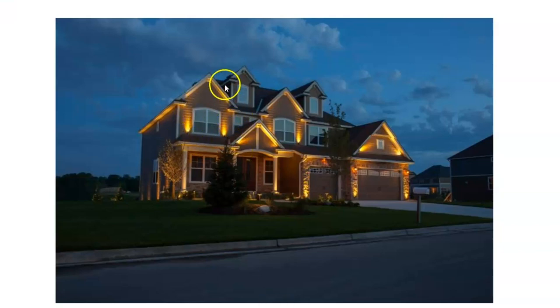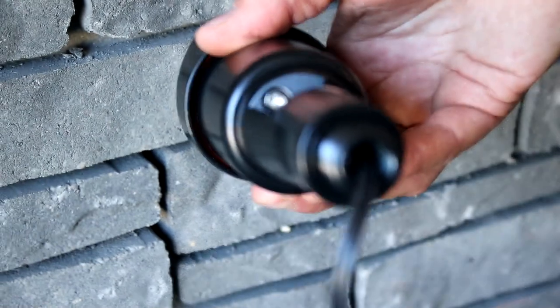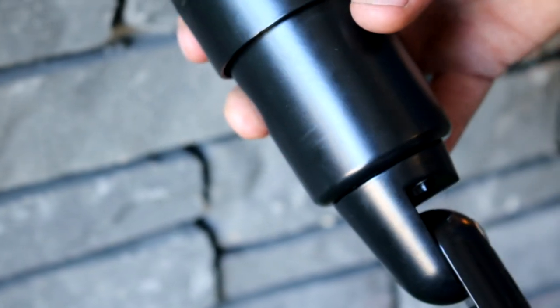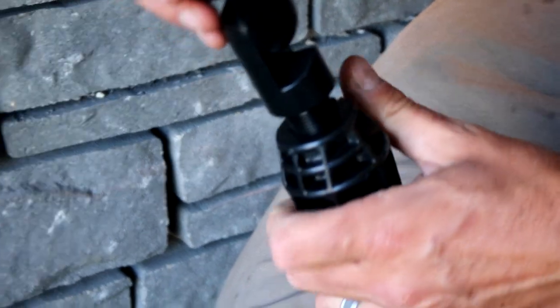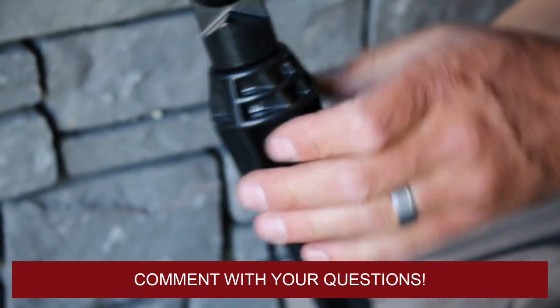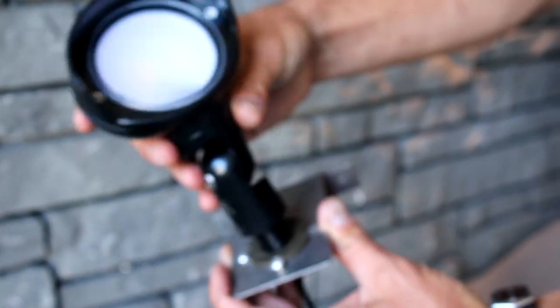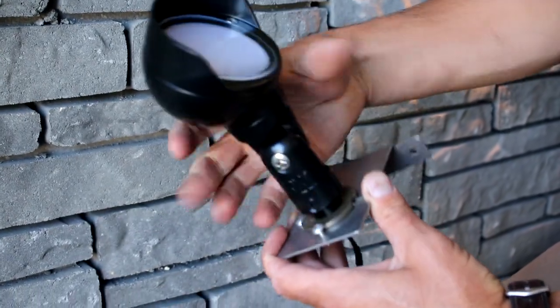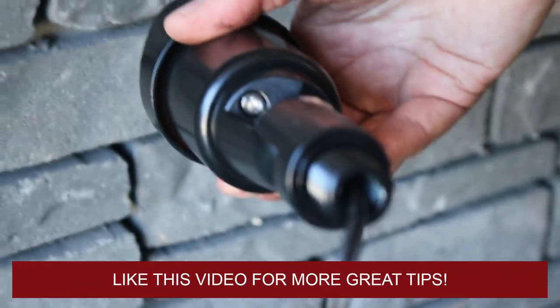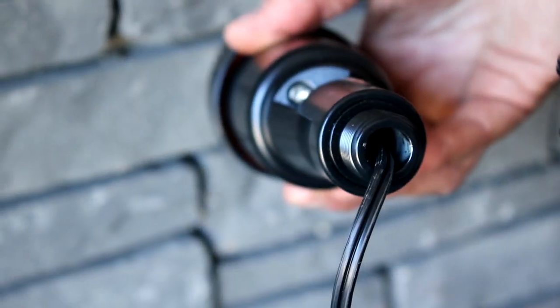Here's kind of a picture of what I'd be looking for. The nice thing is you can still mount all the up lights we use — at the base they have a half-inch male thread. If you go to Home Depot or Lowe's and go to the electrical section, you'll find all kinds of different junction boxes and round flanges and different mounting things. A lot of times we'll just use a nice round flange with a half-inch hole to screw the light into. You don't need big super screws — you can silicone around it so you don't have to worry about water.